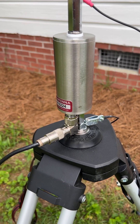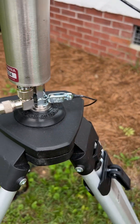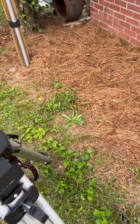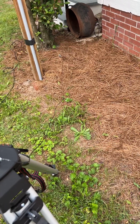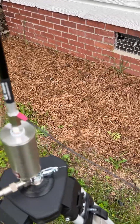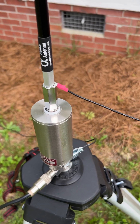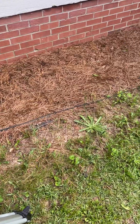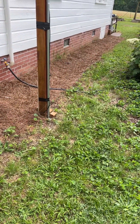Then there's two radials. The bottom one that you see right here is just kind of a snap-on, and I guess that is maybe about eight feet long. It's got a tent stake to it, and it works out really well. Then the other one is up here at the base of the antenna, and it goes out every bit of probably 25 or 30 feet. I just ran it out here to the right, down there, and put it in the pine straw.